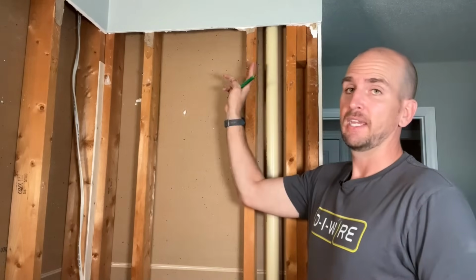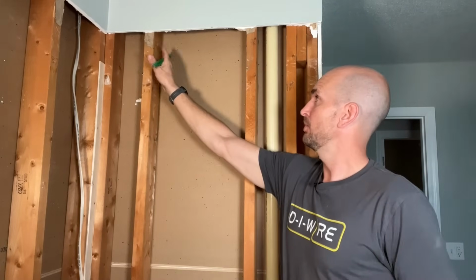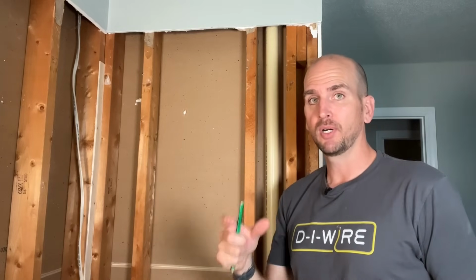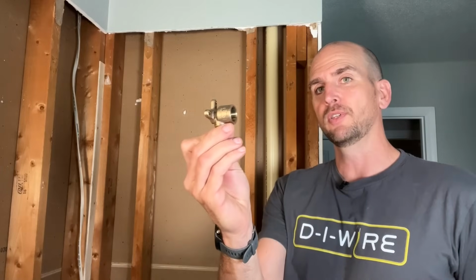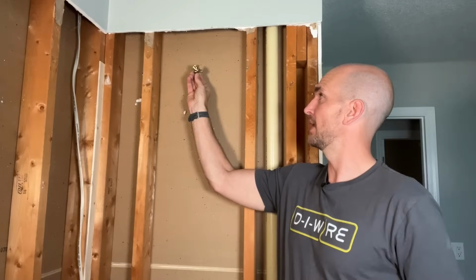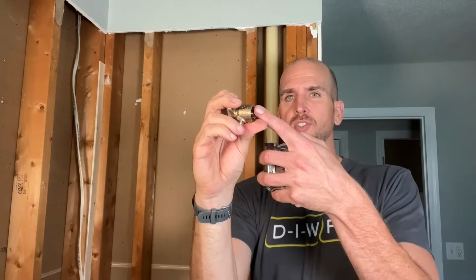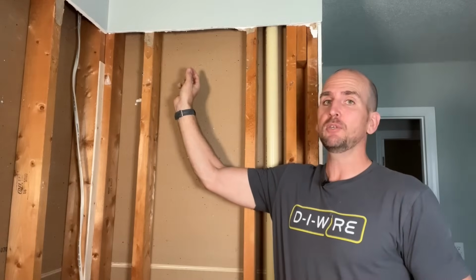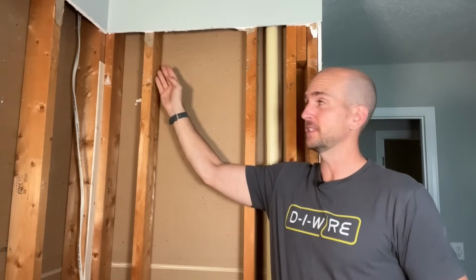So now I have that vertical dimension, but I also want to offset this inside the wall cavity corresponding to the part that I'm mounting. Specifically for this elbow, the back surface will be going on the front of the blocking, and then I have 1.25 inch thickness to the front surface. So I want that front surface just slightly behind my finished surface here up top.